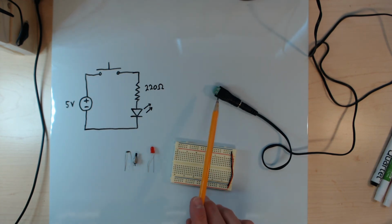And then, of course, I am going to use jumper wires to connect the terminals of the power supply to the power rails of the solderless breadboard. You will also note I have used some jumper wires on the breadboard itself to connect the top and bottom low supply rail and the top and bottom high supply rail. I tend to do that. Basically, it's nice because it means you get both of your supply voltages on both the top and the bottom of the breadboard, which is quite convenient. Okay, I will build this and meet you back here.